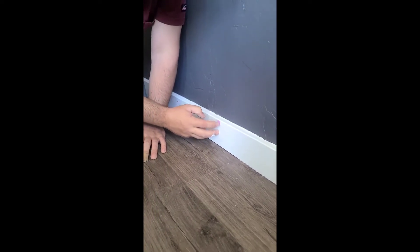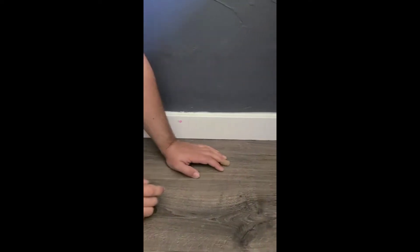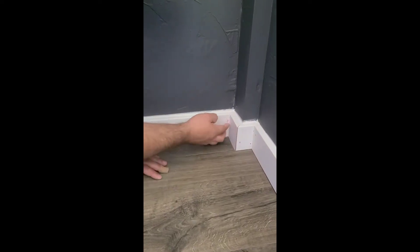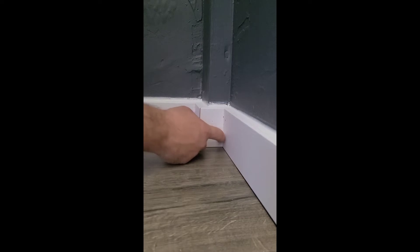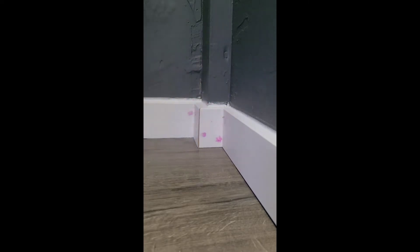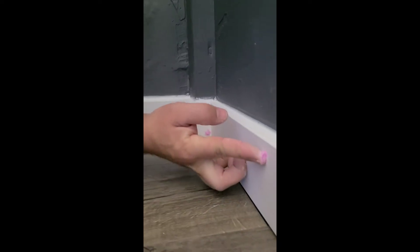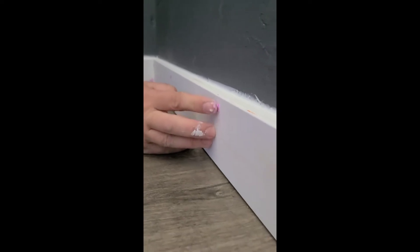You want to start by taking a good look at your baseboards. If you just installed them, there'll be visible nail holes, and you can just fill those. We typically just use our index finger with the spackle and push it into each nail hole. You want to leave a little bit on top and overfill it, because you're going to be sanding these smooth once it's dry. If you don't want to use your finger, a flat putty knife works just as well — they're really affordable. Just be sure to overfill it so the hole gets completely filled.